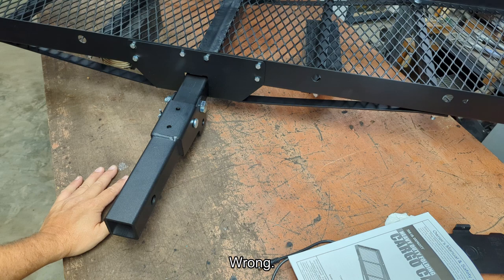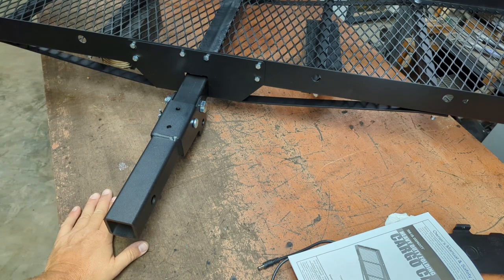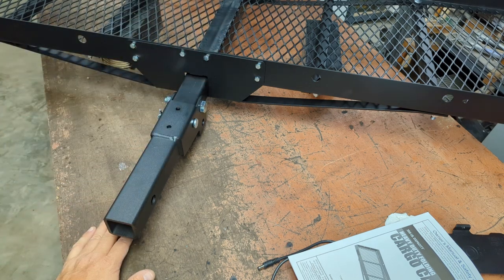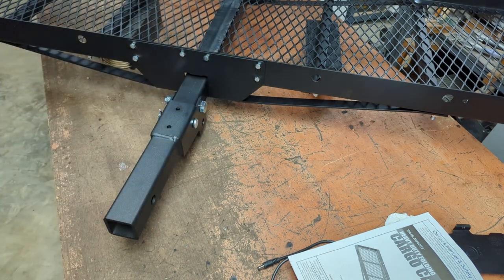So, what else is critical? Okay, the old one, if you remember from seeing, had a jog. I already measured a 3.5 inch rise. I think it was way plenty high enough, but that won't matter. But the distance from this pinhole to where the first bike wheel goes is important, because if it's too close, well, your bike's gonna be rubbing the front of your truck. Ask me how I know that. So we're not gonna do that this time. So I need to do those things. Measure this distance on the old one to make sure the bikes, when they're put on here, aren't gonna rub.